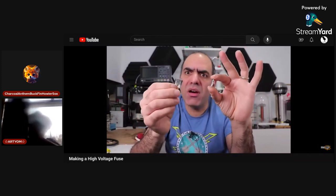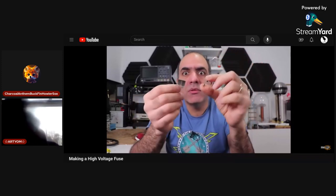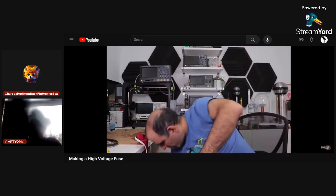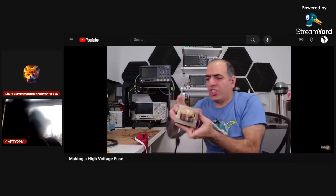So these are short circuits with close to 0 volts across them. Then why the hell do they have voltage ratings? Like this is rated for 250 volts. It's still a short circuit. It's not like if I place it on a circuit with a 2000 volt supply, there will be 2000 volts across this. In fact, let's try it with my high voltage transformer.